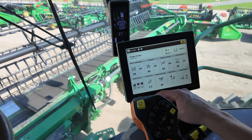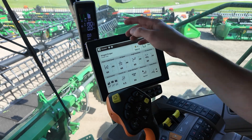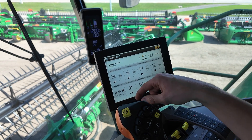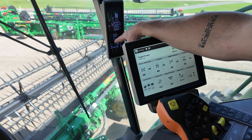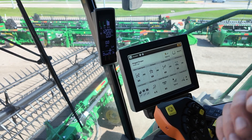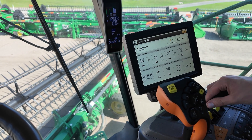From there, we'll also jump in and set our actual automatic cutter height. I'll turn on the header, hit button two, and on the corner post we'll see button two. We'll want to scroll down our cut height until the gauge wheels are completely picked up and the corner post shows roughly zero — if it's 0.4 that's okay, we just want it all the way down into the zeros. You will then see the cutter bar release into our mechanical flex. Note, this is not a Hydroflex system — there's no pressures to set. It's just a mechanical flex to follow the ground.